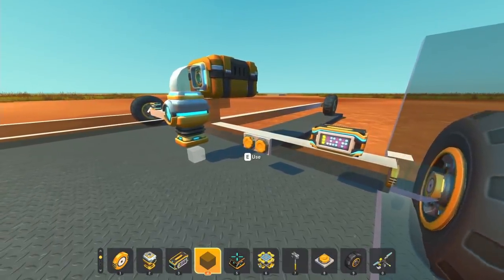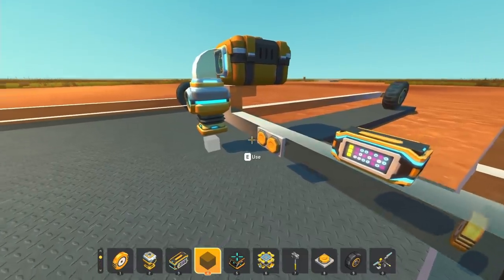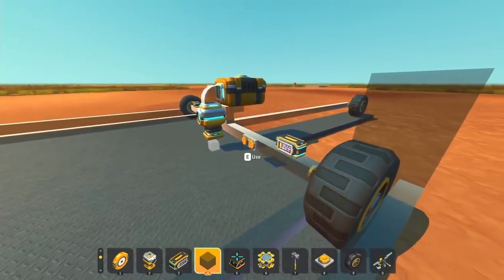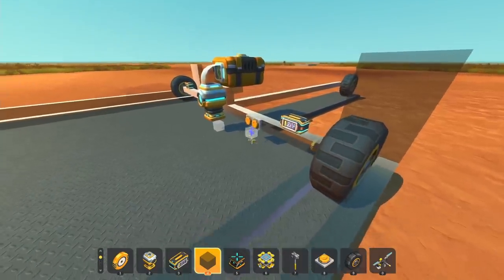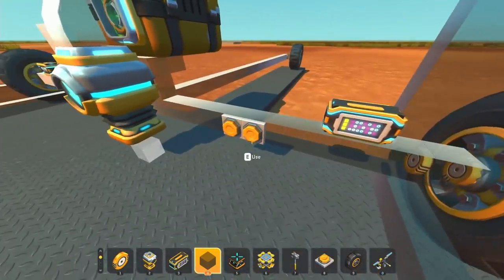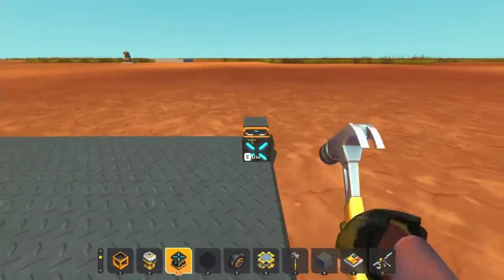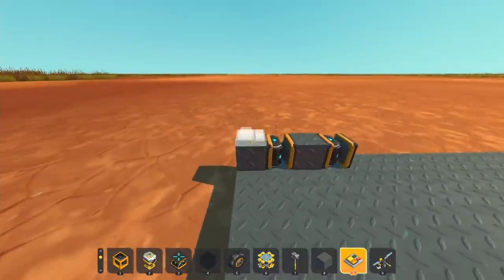You can see how slow it is, because I need it to rotate 15 degrees at a time to make sure I can address every single block individually. The main problem is that as I hit the button for it to go backward, you can see here it rubs up against the wall just a little bit — that means it's falling out of position. After it does that, it actually fell forward a little bit, which means it's slightly out of position again. If I can't get a concrete position because it keeps sliding, eventually blocks are going to get placed out of position, and if I have prints going for over an hour, it's definitely going to be a problem. So I wanted to go for a piston design instead.